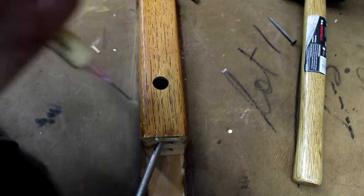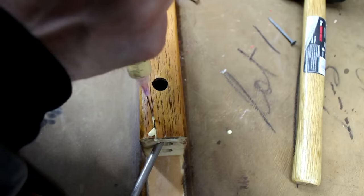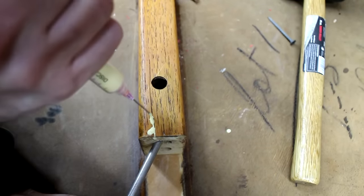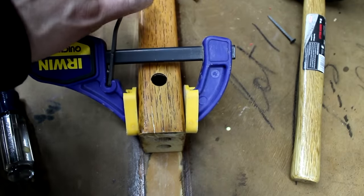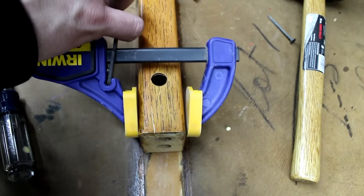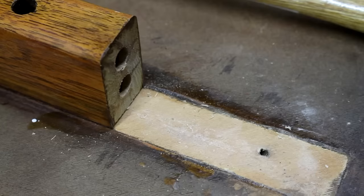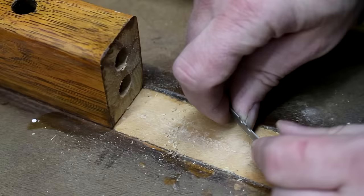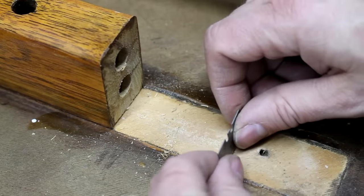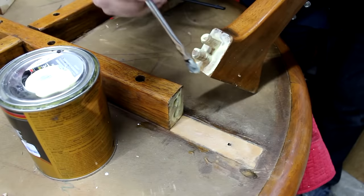This was a good job for the glue syringe. I just forced it open a little bit with a screwdriver and shot some glue in there, then clamped it up. Then I just scraped all of the surfaces with a razor blade to get the old glue off and get ready for the new glue. Then it was time to put on some new glue.